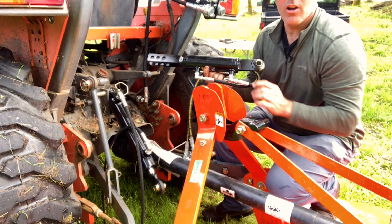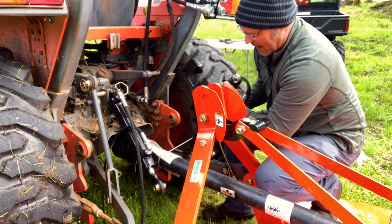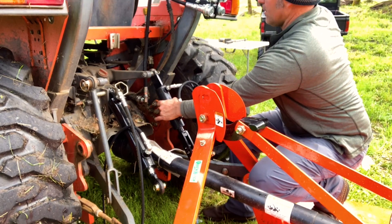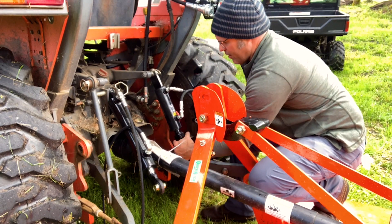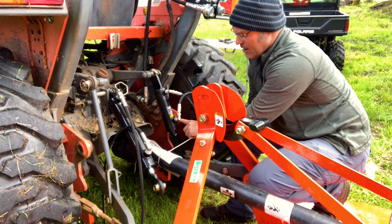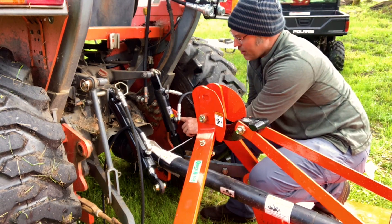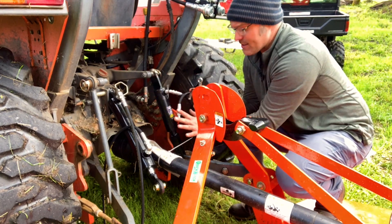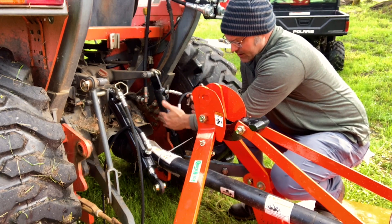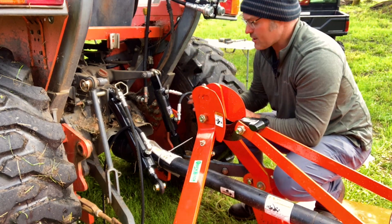As I install this side link it's got three adjustment points on the bottom — I'll shoot for the middle one and we can adjust later. It is tight here with the backhoe connection, so pay attention to your turnbuckles to make sure they don't get into that connection — maybe even bias the turnbuckles a little to the left. The side link cylinder needs to extend to connect, so I'll start the tractor and slowly adjust the controls until I can get the pins in.